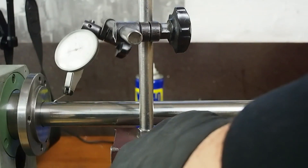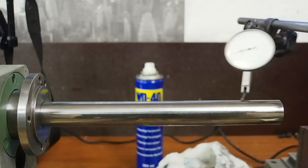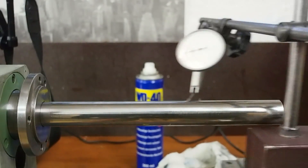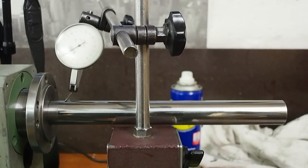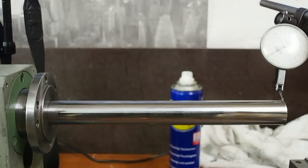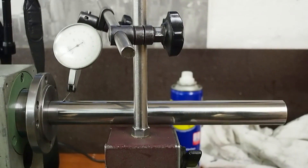Well, that's good news. The changes I've done so far have not really affected the vertical alignment. I'm within two-tenths along my eight inches vertically, which is actually in spec. We'll see how that develops as we finish off the scraping, but so far it's looking promising. This is the vertical alignment — it's looking very good. We're within about one ten-thousandth of an inch across the eight inches, which is less than a third of the limit that would be allowed by Connelly.